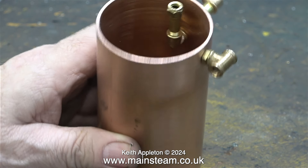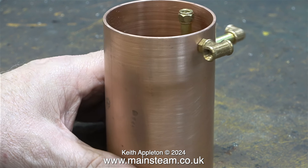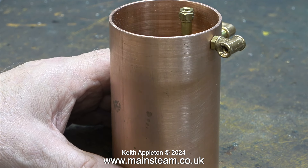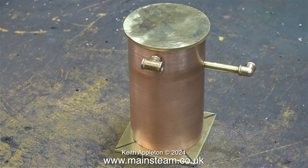I decided to make use of the excess PM Research fittings I have in a box. I fitted an elbow on the inside to raise the outlet to the top of the condenser. I also fitted a PM Research cast tee piece, which needs another couple of PM Research 90-degree elbows so the piping to the twin inlets will point down at the right angle. Externally, the tee piece, elbows, and piping to the chimney will all be painted black. Here are the parts loosely assembled so you can get the idea of what it's going to look like when finished.